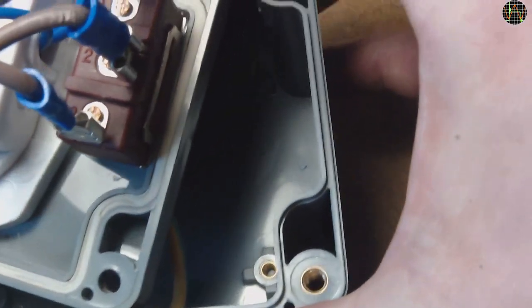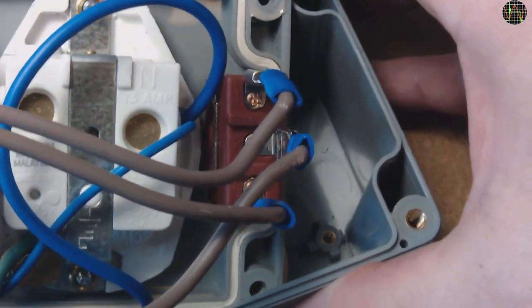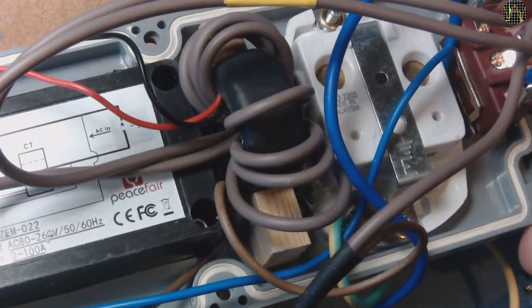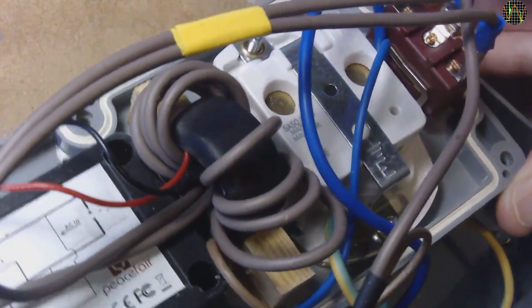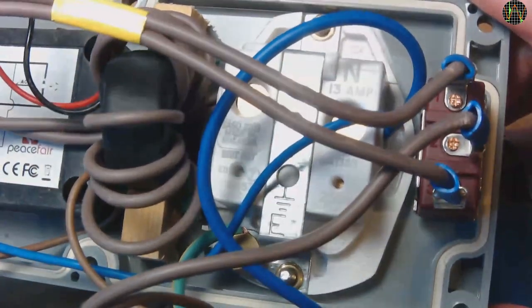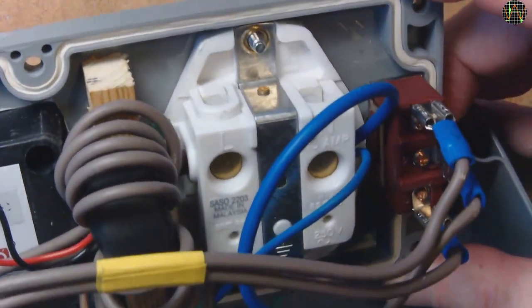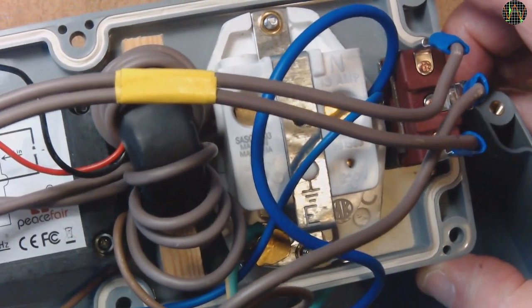It doesn't happen often, but sometimes you get lucky. Despite being so large, the switch just fits neatly on the most right part of the front panel. I printed a label on a piece of paper, put some clear protective film on it, and glued it on the front panel. The additional 10-winding coil is a bit messy, but in part it is because I use 1.5mm² flex rated for 16A for all the load-carrying wires and this wire is quite stiff. The x1 winding is just a straight wire going through the core. I decided to use the same diameter cable for x1 and x10 instead of thinner wire, because you never know — you may have left it in the x10 setting when connecting to a large load like a heater. That way I don't have to worry that the x10 windings are going to get hot and melt.